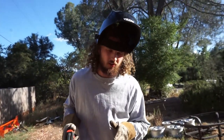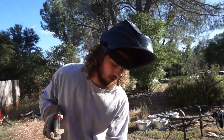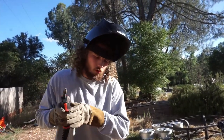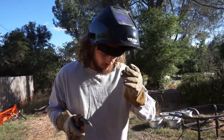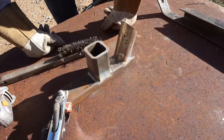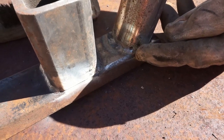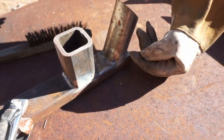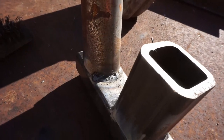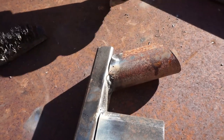So what I'm gonna do is I'm gonna float or hang out on my thick stuff, that 120 wall, and work my way up onto the thin tubing as I can, trying to control that heat. Let's see if that helps. So you can see the hole at the front end, which is where I initially blew through. And throughout the rest of it, we did okay. At the very end, I got a little bit anxious and climbed up and blew another hole. But yeah, it can do it. Just gotta be careful.